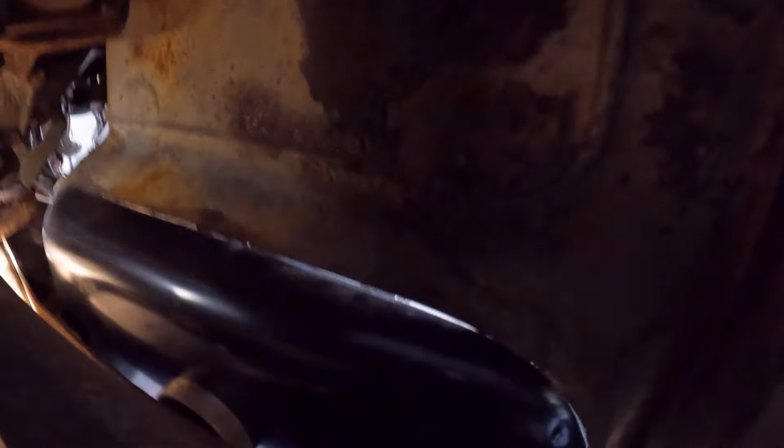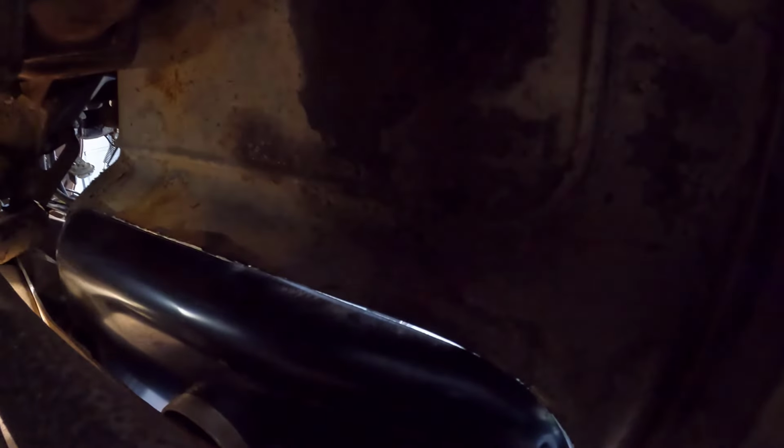Okay, another trick I'm doing up under here is there's a 1-inch piece of tape roll on the frame, and I found that is pretty much the perfect gap for the frame to floor pan clearance. If you put it in here without that, it just kind of falls in, and you have to hold it up. This works really good to sit it in there, and you can put a bunch of weight on it, like I have those lead pieces in here to hold it up against the cab mount here.